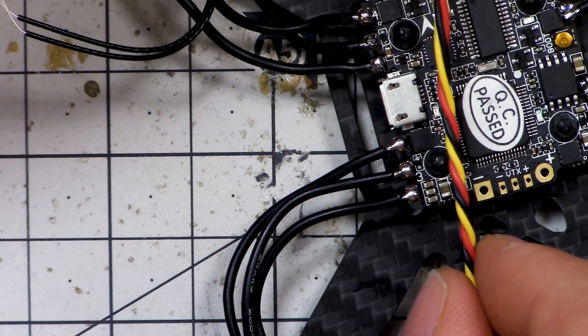We didn't really need a lot but we don't want to break it once it's in there. What I like to do is just twist it — it'll kind of spool up on itself, and if you need to pull it out you have a little bit extra. I always leave myself a little more than I think I'll need. It's nice that this Caddx camera came with silicon insulated wires — definitely everybody should do this. The plastic wires that come with some cameras, I think they all do silicon now, which is great.